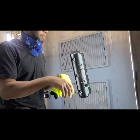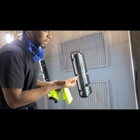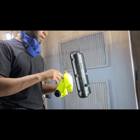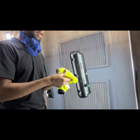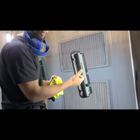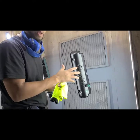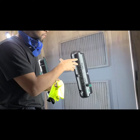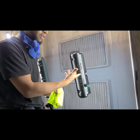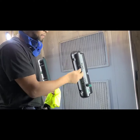And the process is going to be, after it's all sprayed, depending on where I'm at, it depends on what finger I use. But what I do is dampen my finger and wipe the part, just a little bit. You only want to wipe maybe about an inch or two at a time, to keep it from falling off onto another part. The thing about powder, once you push it off of one spot, it's already magnetized, it's going to try to jump in somewhere else. So you don't want it to get back on the part. Anyway,